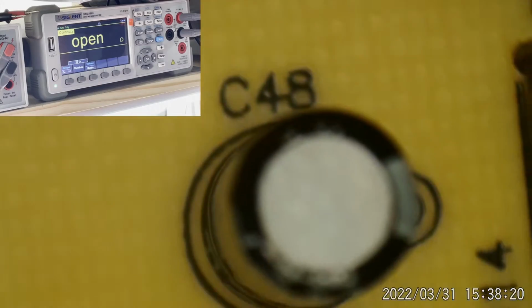I'm just looking at some burn marks on this board. This board has been hot over here. No, it's a whole other part of the circuitry. This is over in the 5-volt area. We'll have to take a look at that. That has been smoking. Really, really warm.